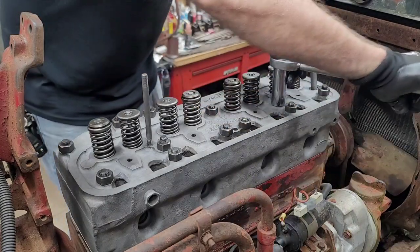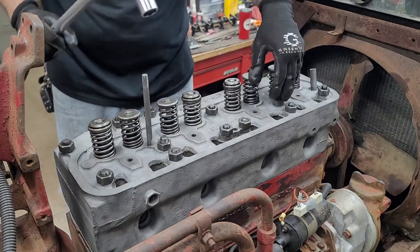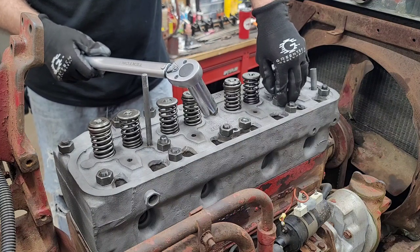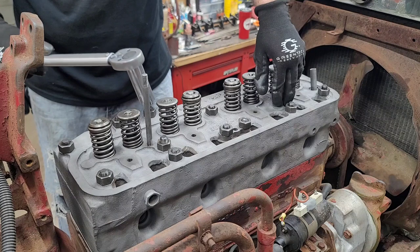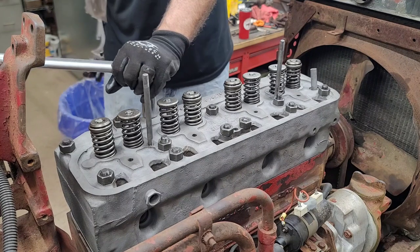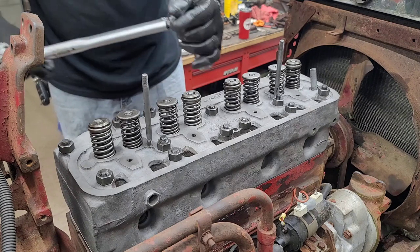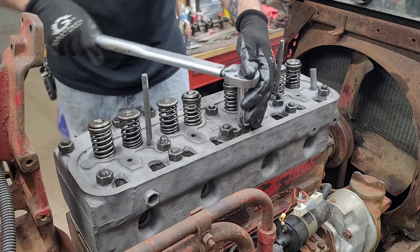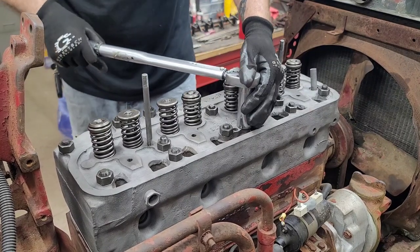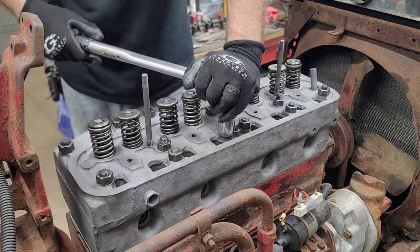So I did contact a company, I think they're called BK Diesel, about the number 3 diesel tractor, because the guy told me when I got it that some diesel is working its way into the oil. From what I found out, obviously the injector pump has a bad seal on the front of it. So I'll have to get a seal kit for it.